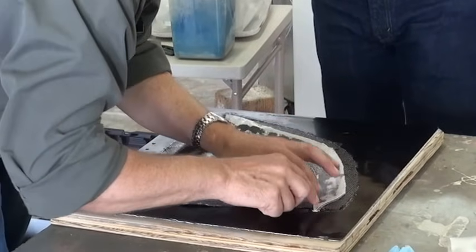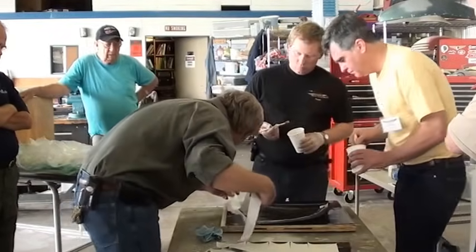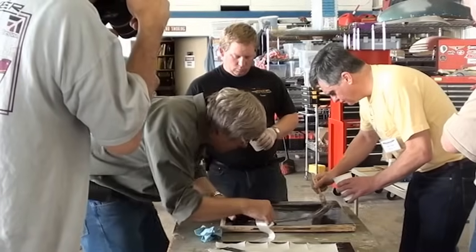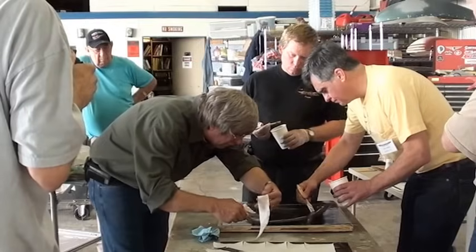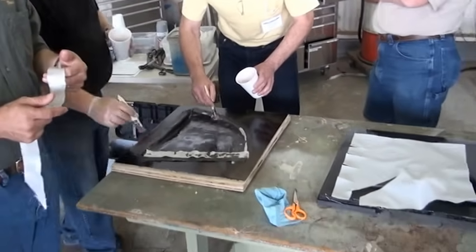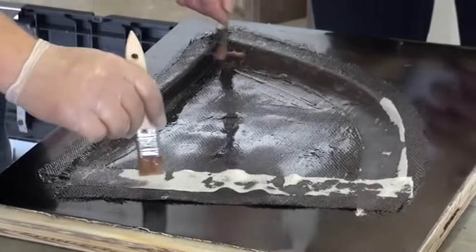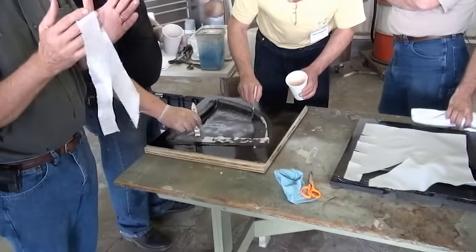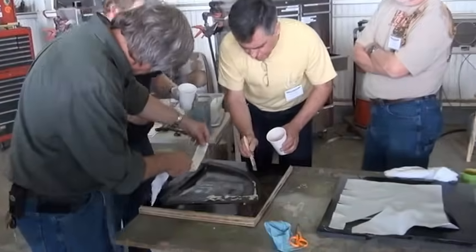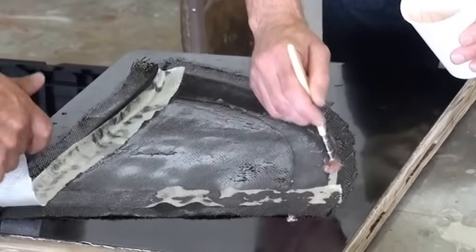And my reasoning for doing this layer of glass in here, let's see, right there, around the outsides, because that's where the fasteners go, I'm guessing. When I glue the two halves together, and where this touches the aluminum part, carbon fiber is not a good matchup against aluminum, and it'll cause corrosion and electrolysis to go on there. So these parts will actually provide a barrier against the aluminum, and then when we actually glue the two carbon halves together, it's easier to glue the E-glass together than it is carbon to carbon. So it'll provide a little bit of extra.